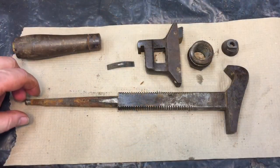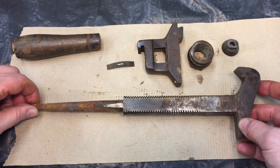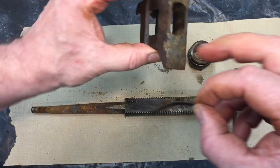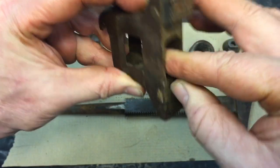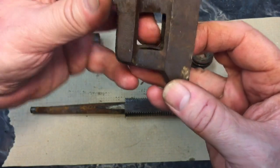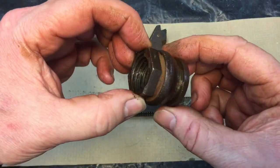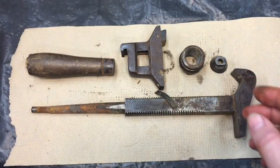Here we have the wrench disassembled. You can see there's not much — here's where you check for any bends, and this wrench looks perfectly straight. Over here there's a piece of spring steel, and you can see the wear mark on here that goes on the flat side. There's a little pocket that it gets tucked into. Remember, it's got to be bowed outward — that gives it the action so that you can use it as a pipe wrench. So you remember where that goes, and now all we've got to do is clean everything up.